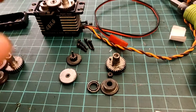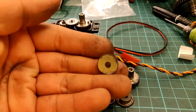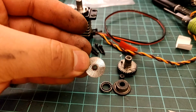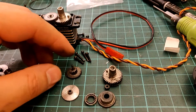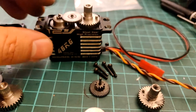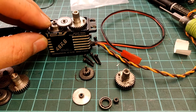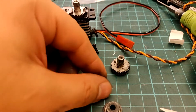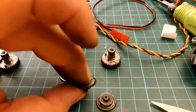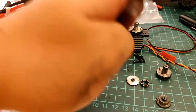The second gear set was much worse. Looking at the photos: the second gear, which connects right to the motor, shows a wear pattern that wasn't machined in — that's from the wear the gear experienced. The teeth are completely gone on the motor pinion gear. The secondary bell-shaped gear has also completely sheared off — it's supposed to be intact but has just come off entirely. Interestingly, the gear that engages the top gear is actually fine despite having metal shavings from the broken teeth.